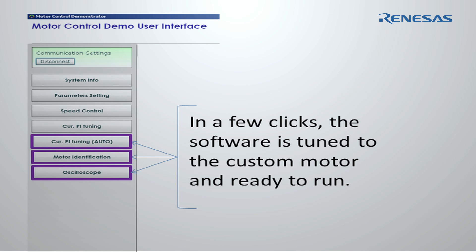Now it's time for a practical session. The Renesas low-cost motor control reference platform is designed to drive any kind of permanent magnet motor, providing interesting features such as autotuning, sensorless, and vector control. Today we will tune together a 24-volt motor using the reference platform, an external 24-volt power supply, a PC GUI, and an isolated USB connection.